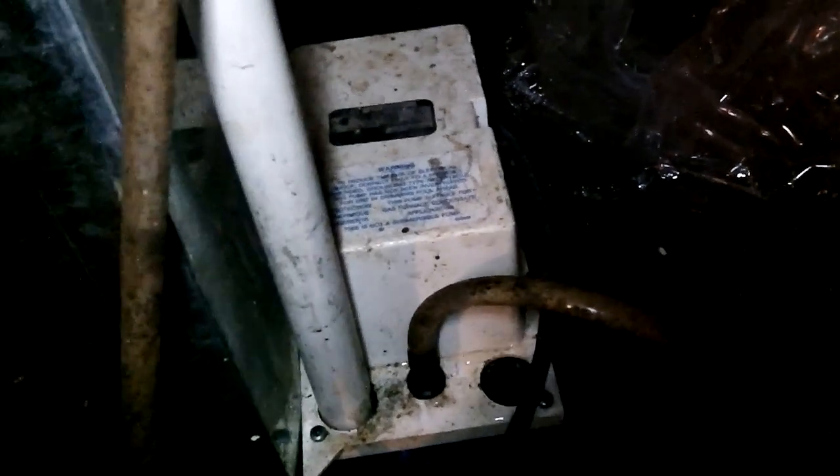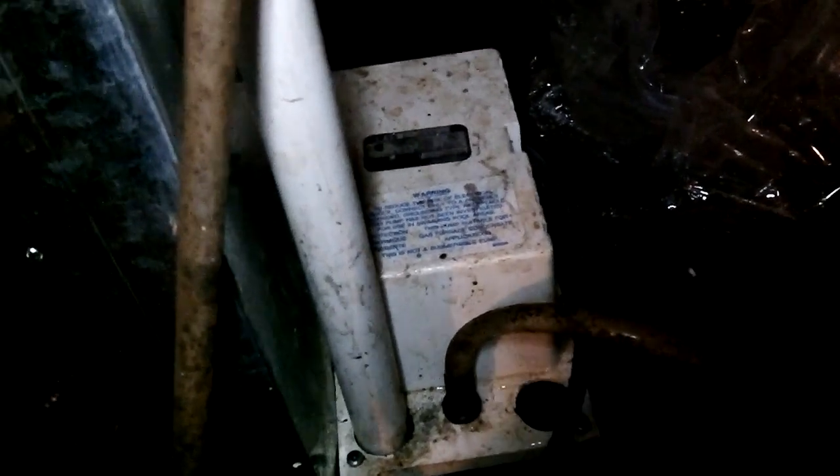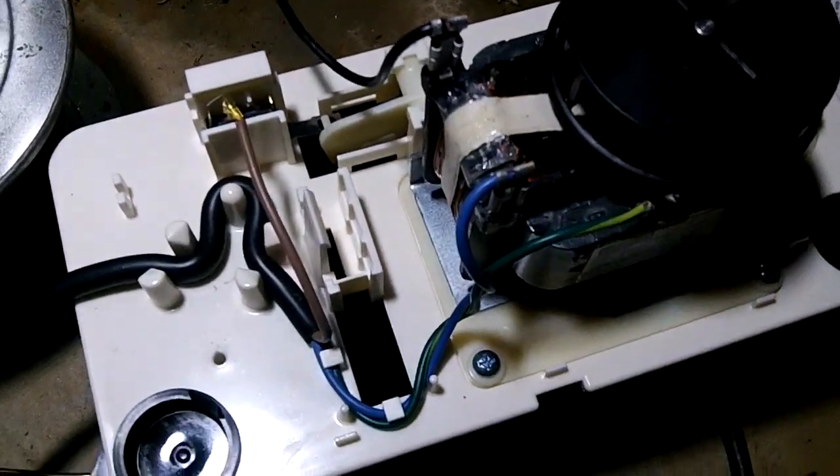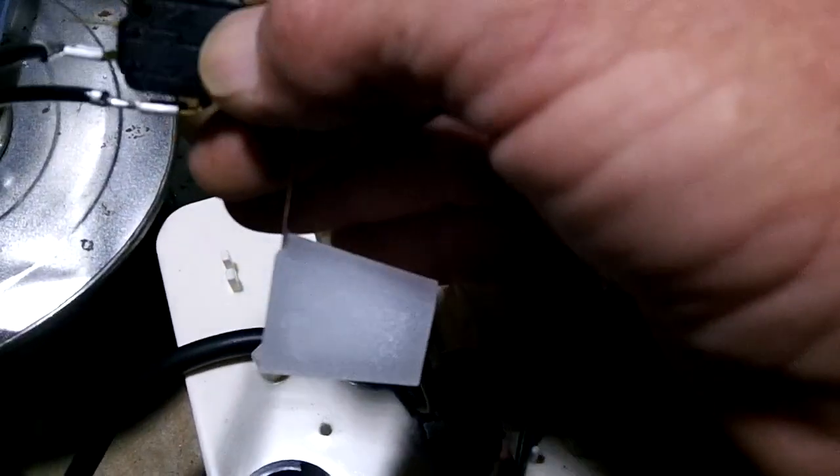What I'm going to do is replace the pump — put a pump in that has a float switch — and then add a relay, and run a wire to the line set to the low voltage of the upstairs, to break the signal going to the outdoor unit if the pump ever overflows. I have a brand new pump set in here, and the top is off because I have the float switch in my hand.